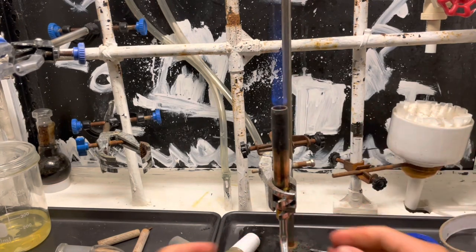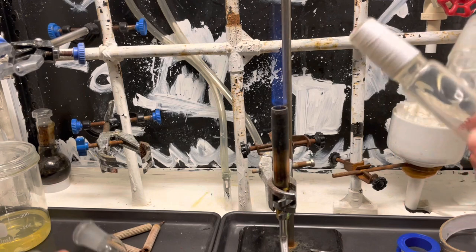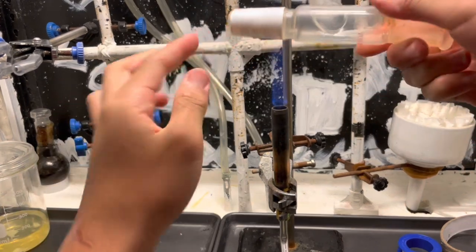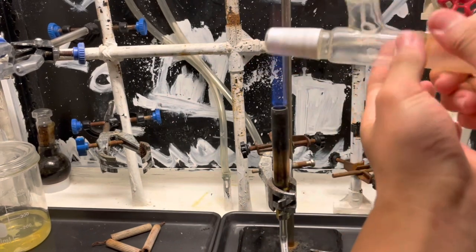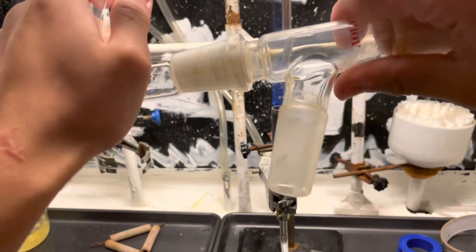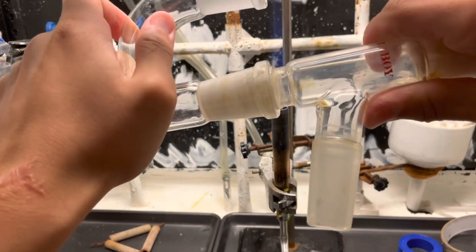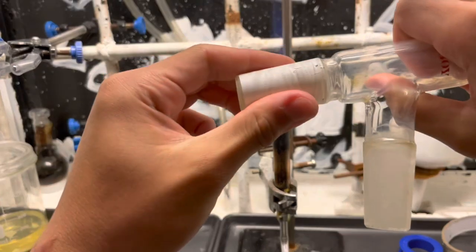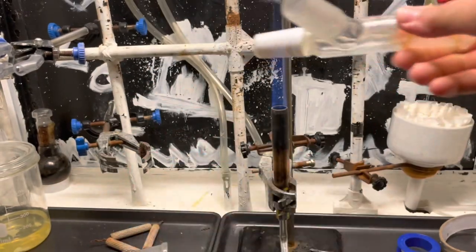So now simply take out some sort of fire source, such as a blowtorch, and simply heat up the Teflon. Now do this under ventilation. Heating up Teflon gives off nasty fumes. Now we aren't quite heating Teflon to its melting point, but its plastic transition point, which is around, above 300 actually, where it goes semi-translucent. I would know because I actually did that once.